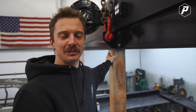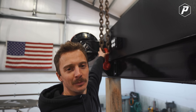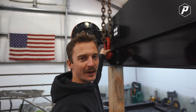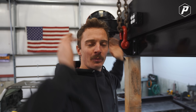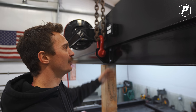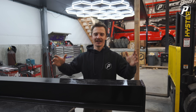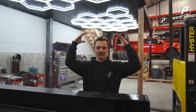If you didn't see the video where we were trying to get this post out of the way — I built these brackets and hung this chain from the ceiling to help hold and support the loft. When you pull this out and this chain starts holding all the weight, this beam right here wants to twist out because there's leverage on the outside. Everybody roasted me in the comments saying I should've hung it from the top, which is a great idea and originally what I wanted to do, but I didn't want to deal with cutting into it and trimming it all out. So I came up with a better solution. I got with the guy that actually fabricated the shop and he built us an I-beam that's going to go up in place and keep that beam from twisting.